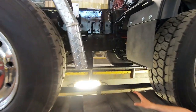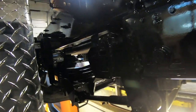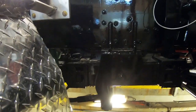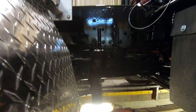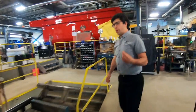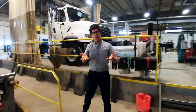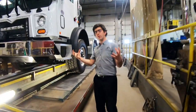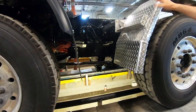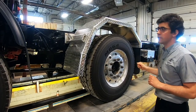Let's have a look at the suspension — the 74-inch front spread suspension with the equalizer attached to the springs on the first and second axle. One of the perks of the AMS40T2 twin-steer is easy access to the suspension from underneath or from the side. You don't have to dismantle or unmount the whole thing. In this case the TerraPro doesn't have any equipment or tanks on the side, so access is completely free.